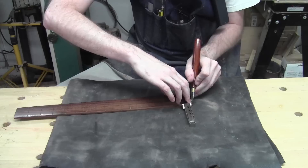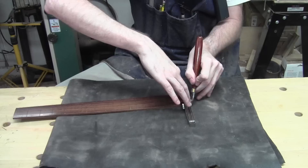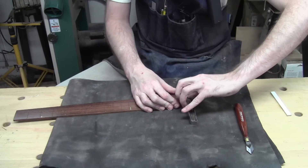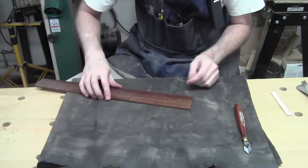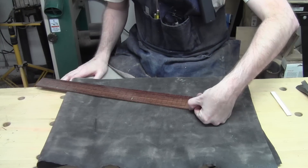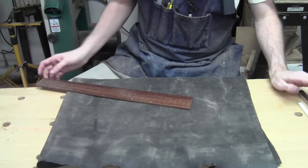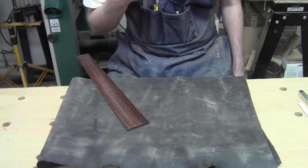Let me try that line again — yeah, that's better. I'll very carefully remove the feeler gauge from the slot. Now I can sand or scrape up to that line. It won't kill me too badly if the edges get there first and leave a little in the middle — I just want to get that diagonal out. This was the most accurate way I could think of to get a mark there, so we know where to go. We'll just do this over at the belt sander.